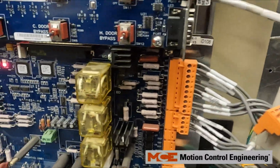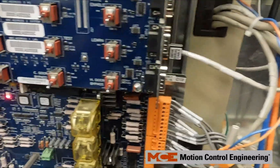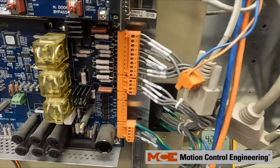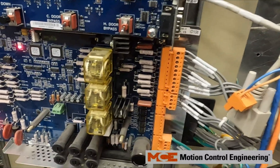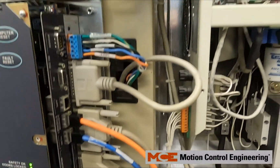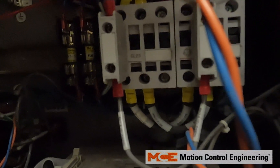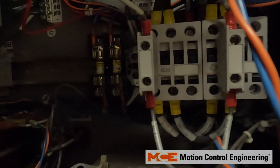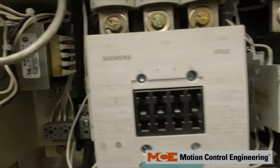That covers motor contactor driver proofing fault. You may also have a brake driver contactor proofing fault — it's pretty much the same thing. It's your proofing circuit for your brake contactors, which are inside your eye box. There you would have BK1 and BK2, and you have those auxiliaries mounted on top of BK1 and BK2 — they're not side-mounted like your M1 and M2 contacts.